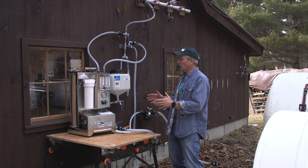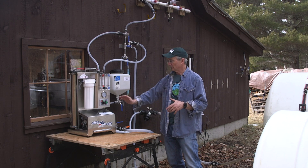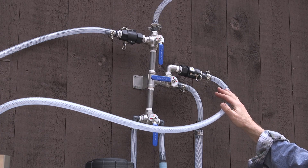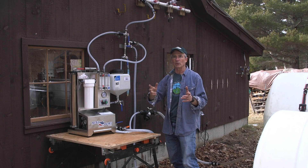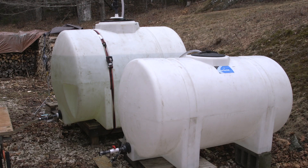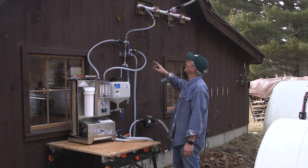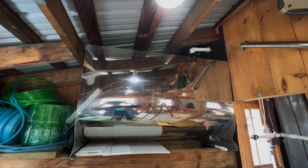I've never put in an RO before, I've never used an RO before, and it was really straightforward. Let me walk you through the elements. Mini Micro, optional wash tank, optional valve kit. This valve kit is going to save you a ton of time when it comes to putting it into different modes. I also have a strainer used to filter the raw sap to make sure no debris gets into the pump. I have two tanks: a sap tank at 500 gallons, and a permeate tank next to it that holds about 325 gallons.